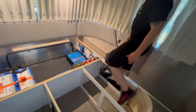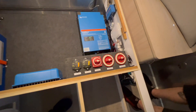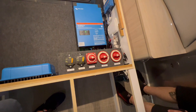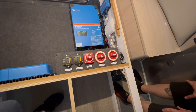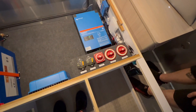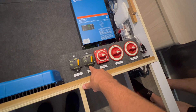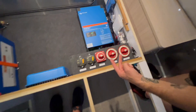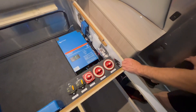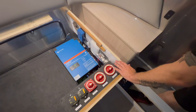Explain the breakers and switches here — why would someone need to deal with those? We have a solar breaker and a breaker for the DC-to-DC Victron Orion. Those are protection in case of a surge — they'll shut themselves off. Then we have on/off switches for solar: one between the solar array and the charge controller, one between the charge controller and the battery bank. We have an inverter on/off that just cuts the inverter out, and then a master on/off that will shut everything off.